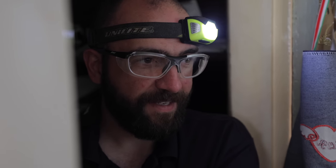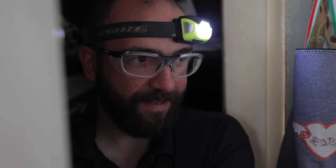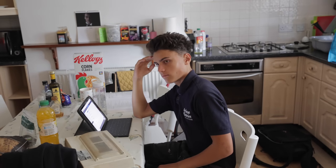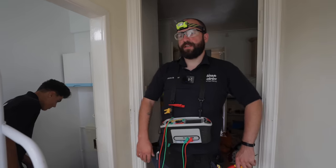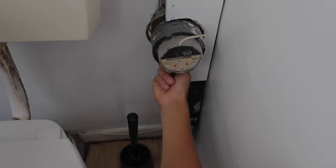So your TNCS is 0.35. Your TNS is 0.8. So it's below. Yeah. But you can see it's a little bit higher. And then 200 for your TT. Check the connections and all of that lot. Tell me if it's any good. Oh, yeah, that is. That's just pulled off.